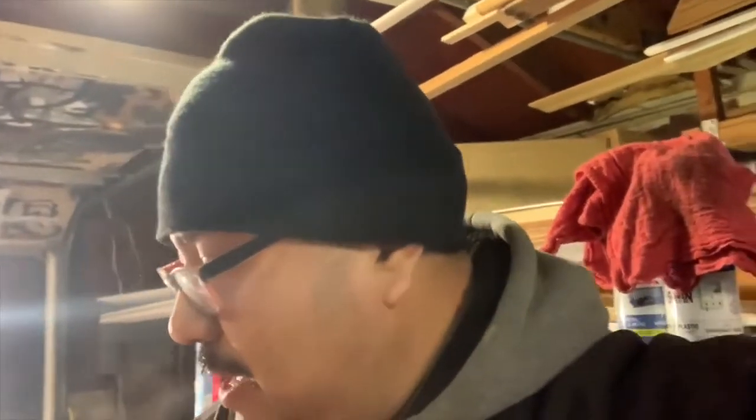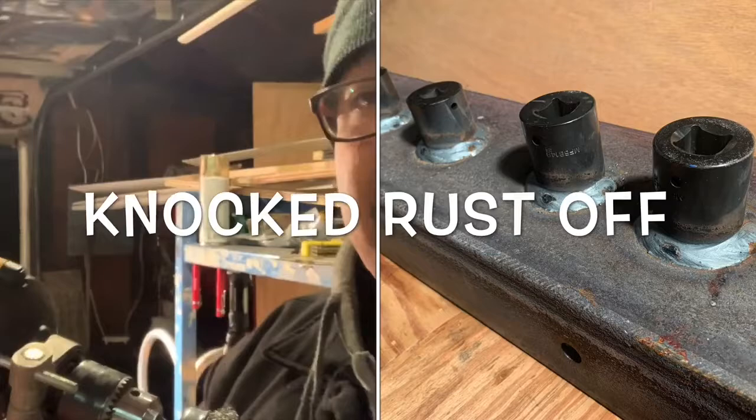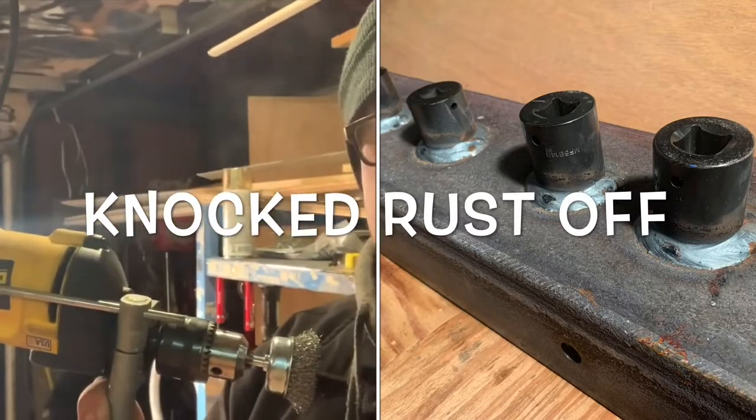Back in the day we used to call these things lollipops. I'll show you where the screws with the bolts are going to go into that metal. I used this — it's a cone-shaped sander. As you can see, it wore out a little bit. We used this to make sure that we deburred the holes. And then after that, we used this little wire brush to kind of clean it up. Ended up using my DeWalt — real nice and handy. This is the hammer drill, but it also has the drill mode. I like using this because you plug it in — electric — and you get unlimited power. Well, until you blow a fuse or something.